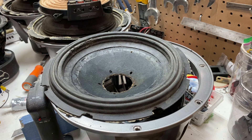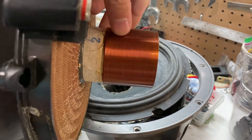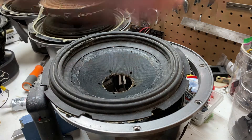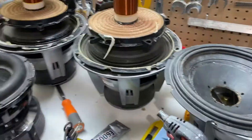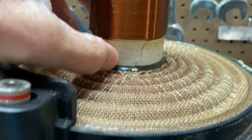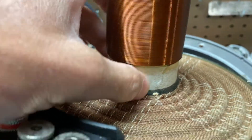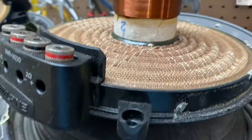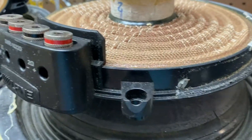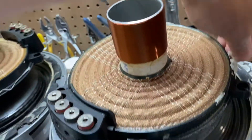I'll send you this video — you can see what you think. The first thing you want to do is make sure that your coils are intact. If you're getting your ohms at those locations then your coil is good. If you're getting a bad reading — a zero or an overload — then your coil is shot. That would be the first thing I would check.